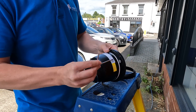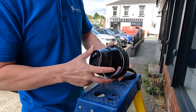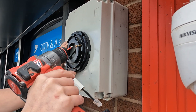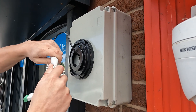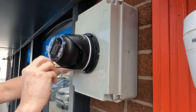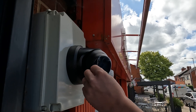Installing this camera is pretty straightforward. I just need to take off the backing plate that the camera itself mounts to, using the T10 or T20 Torx bit that's provided in the box. Once that's undone and the clip's fallen away, you can just separate the base and the camera itself. Installing it is just a case of doing that in reverse — mount the base, slide all the cables back into the base, put the camera into position, and tighten it down with the Torx bit. Position the camera how you need it and don't forget to remove the film off the camera lens.